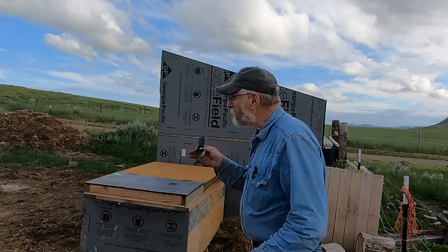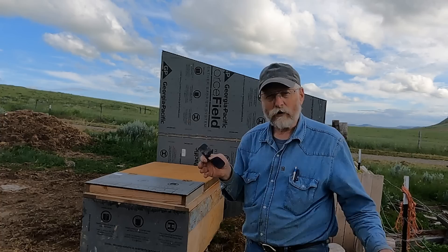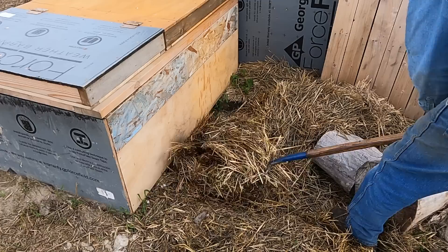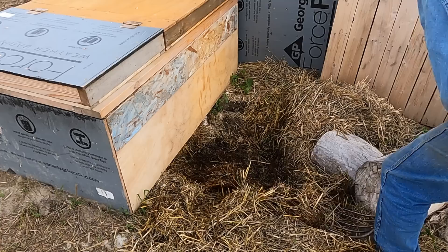In the process of all this runoff from the side hill down into where the shed has been and where I had the water tank for the cows through the winter — remember I trenched my water line down to my water hydrant — some of that has settled because of the heavy rains. This was my insulated box and I had straw stuck around it to kind of help against the freeze. Well, this is really sunk and settled in, which isn't maybe too uncommon.